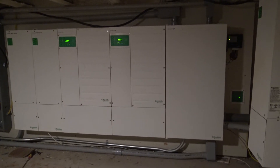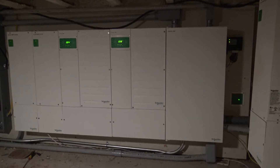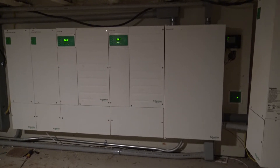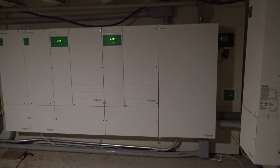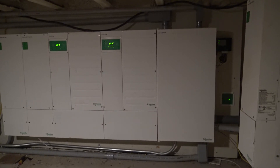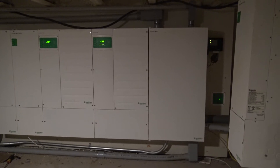If you go around your house with a measuring device and check your refrigerator, AC, dishwasher, and washing machine when they're running — some even have tags showing amp draw — you can add up the amperage it takes to run things. The key is that devices aren't running all the time; they only draw amperage when working. Your air conditioner is probably going to run the most. When my air conditioner kicks on, it draws about 60 amps, and I'm only making 80 with this system.